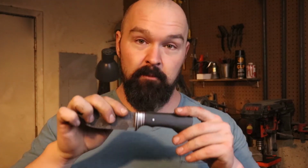It works great. That is the trick to use, man. You just glue up your guard, glue up one half of the handle, stick your hole through, glue the other half on, stick your hole through that half, bam. Everything is just as good as it can get. I couldn't be happier. I've never had a line on the base of my guard this tight. It's perfect. It's like it was made in a factory. So that is definitely my go-to method from now on. I'm gonna be using that on any knife I have that has this type of handle design.